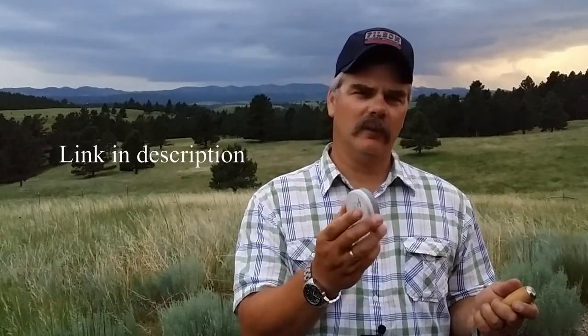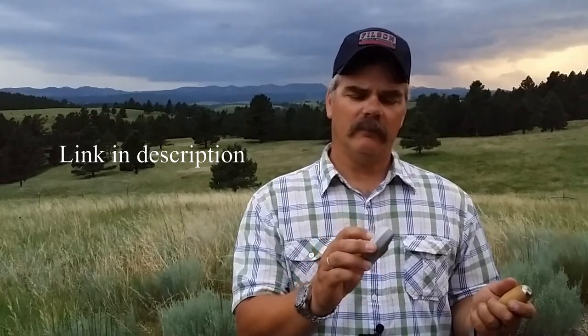That's how you sharpen your draw knife. Thunderstorms seem like we do a lot of that around here. Basically you're just taking your stone and riding that bevel in circular motions, and you check the back as well. These stones are pretty easy to find on the internet or on Amazon. It's a 200 and 400 grit stone — the fine grit side is a little bit finer and I like to use that one.